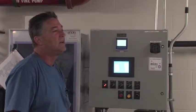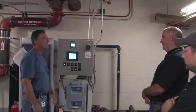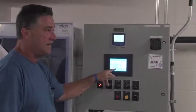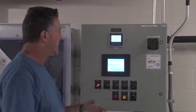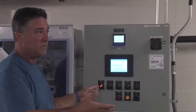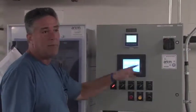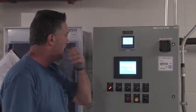That's how you'll know at the end of the month — in those three days, if it ran. Pump control: we have alternate, so we're cycling both pumps. That's going to be different at different cycles — one time per month, number one pump will run twice and number two pump will run once, because we're only cycling it three times, so it's just going to do that alternating.